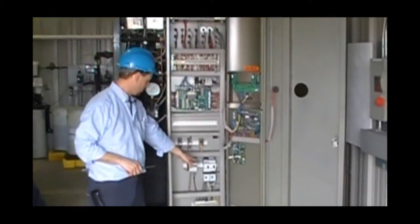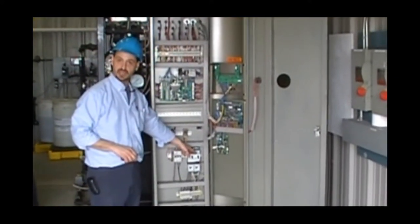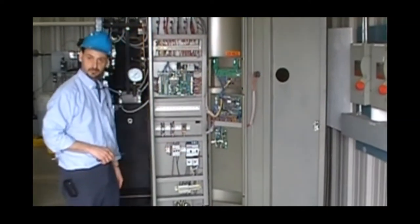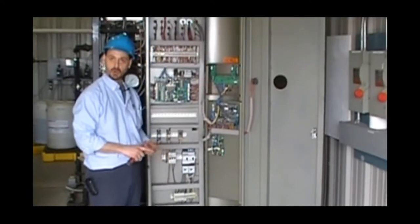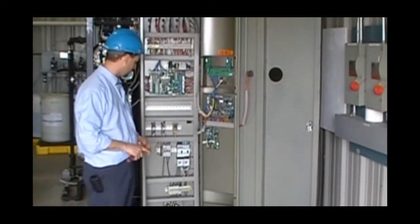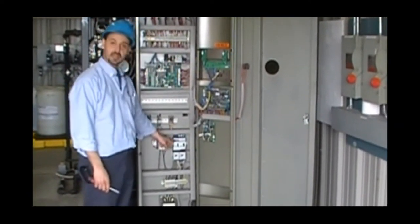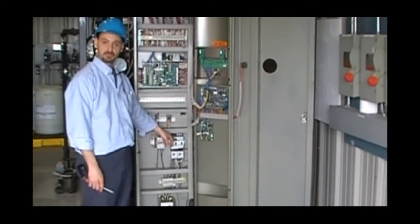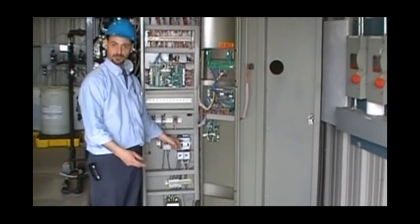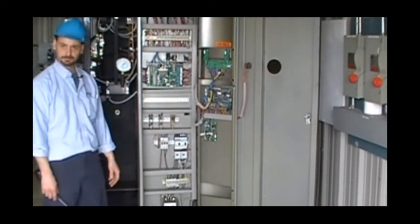Takes us down to our water pump, fan motor, contactor and circuit breakers. Number one priority here is to make sure that the wires are tight and secured. Number two is that the amp rating of the circuit breaker matches the nameplate rating of the water pump and fan motor, and set it accordingly.